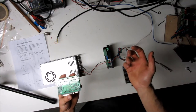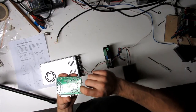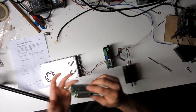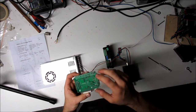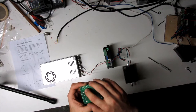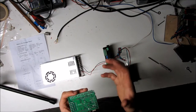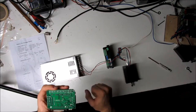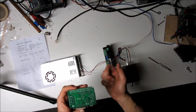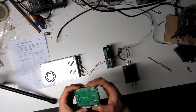On my system I run a DeWalt router, so I don't need the 0–10V output. There's plus 12–24V and ground for board power, a normally-open relay contact assignable in Mach 3 software, and along the back starting from the left: X pulse, X direction, Y pulse, Y direction, continuing through to the fifth axis (B). There's also a pulse-width output, the 5V PC power supply pin, and a 5V ground.